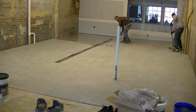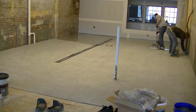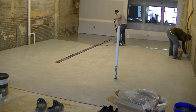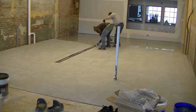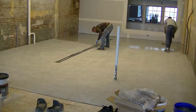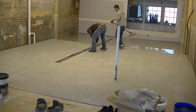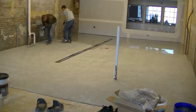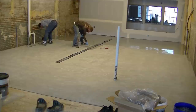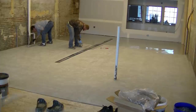Now we're using a hybrid type coating — it's a polyurea polyaspartic hybrid that we're putting on for a base coat. The reason we're doing that is because this stuff cures really, really fast, so we can complete the whole process in a day. It would be perfectly fine to use some type of epoxy as a base coat. I have all the products I use — epoxy, polyureas, polyaspartics — in that course too. You definitely don't want to use the big box store products for epoxy coatings in your garages. They don't last. We grind those things off all the time.